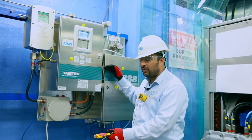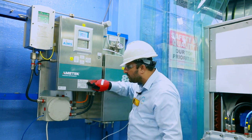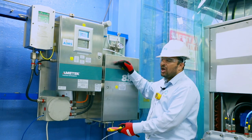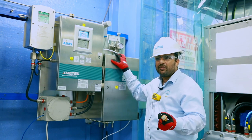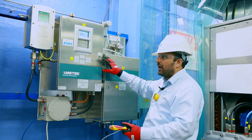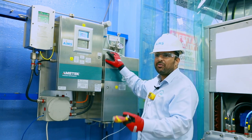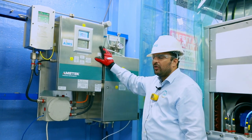This analyzer is unique because it has a 60 degree ambient rating with IP65 — the first tail gas analyzer with this specification. You can directly mount it without an analyzer shelter; a simple three-sided shelter on top is sufficient, with no need for a big analyzer shelter, cabinets, or HVAC. The xenon flash lamp life is more than five years, compared to the Model 900 where lamps needed changing every nine to twelve months.